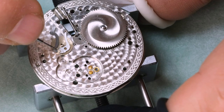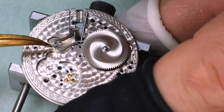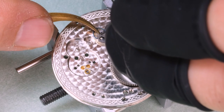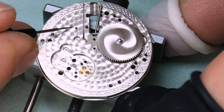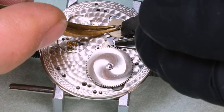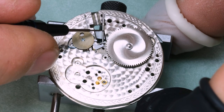These two levers are part of the negative set. What they do is they still move the sliding pinion back and forth, but in the opposite way of what it would do in a typical keyless work setup. The negative set was quite crucial for being able to choose your case and your movement. While it was a good solution for that problem, it's not really relevant today — but it is something you'll come across in pretty much all American pocket watches from the period, so good to know about.